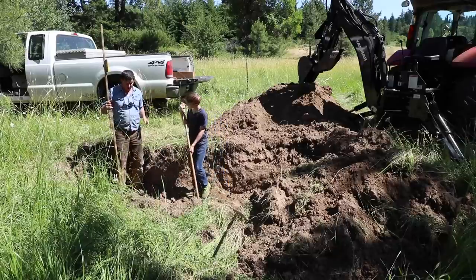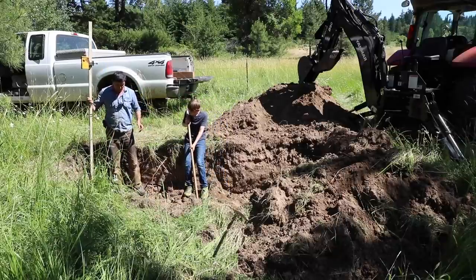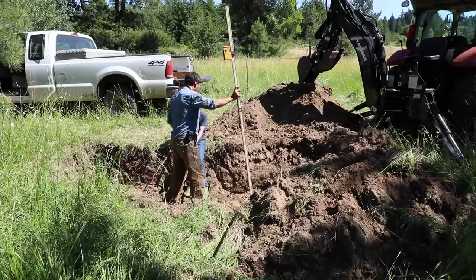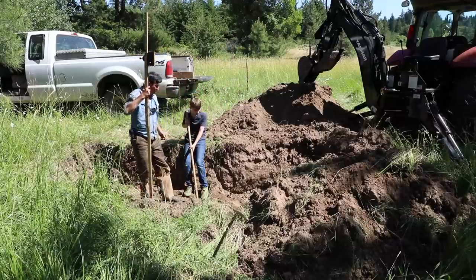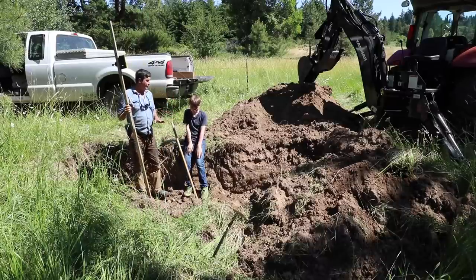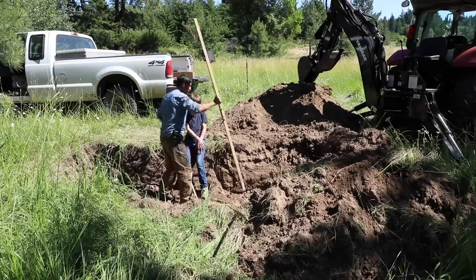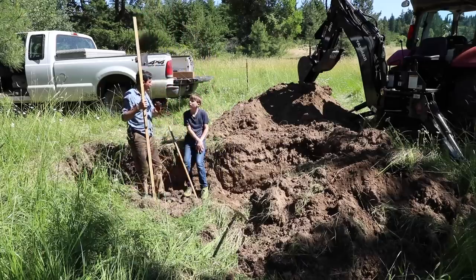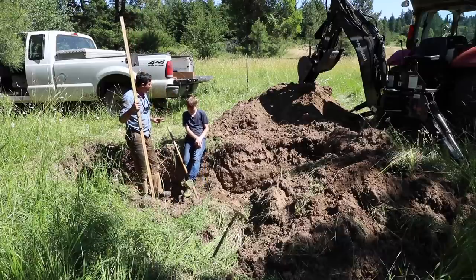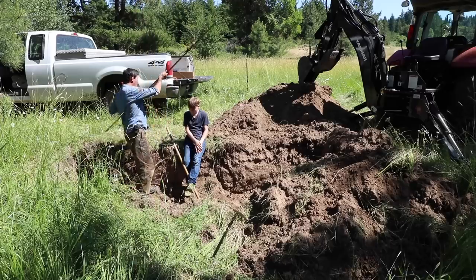When you're checking grade for a machine, you don't have to be real precise, just quick. Check in three spots — we're about a foot low there. I haven't run equipment for a long time; we used to be able to dig flatter than this. So you have to see this and know it. When I'm dumping, you come over here and check — communicate to me. You should be working with me, communicating back and forth so that we don't remove any more dirt than we have to. Let's rake this out and then we'll put our gravel in.